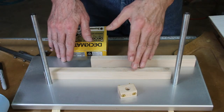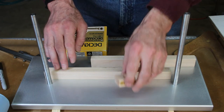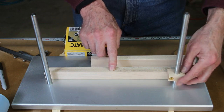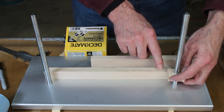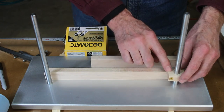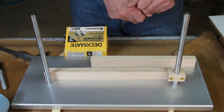I've been debating how to make a connection point between the support rods and the clock. I was thinking about making them out of aluminum, but I've just made a prototype out of solid maple — the same material as the clock. This would screw right into the clock and ride down onto these support posts. There's enough screw penetration into the maple that it'll really bite in quite strongly, so I don't think I need to use aluminum — this compresses the cross grain and is going to be very strong. I'm going to make up four of these and try clamping them on just to see how it feels. If that works, I'm going with wood; if not, I'll go with aluminum.